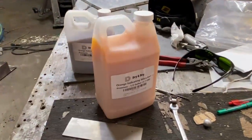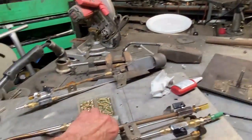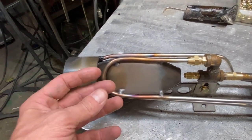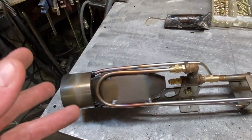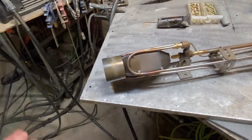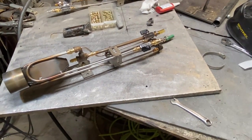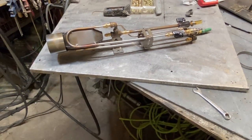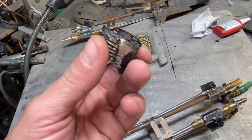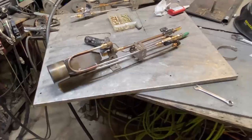That was part of what killed us. When you start getting a bunch of dirt and gunk going through the line, all that gunk and oil can start to carburize in this area, and flakes of carbon will build up and restrict flow. Another thing — we had so much hose on there. All those little water drips running through the line cause eddy currents in the air, and that significantly reduces airflow — it's just tumbling air in there. We're going to have to try this again. Today's experiment was somewhat of a success, but it failed in the end because I wasn't able to sustain over 4 cubic feet per minute. We did manage to melt the wrought iron pipe, but just barely — I'm not even going to count that.